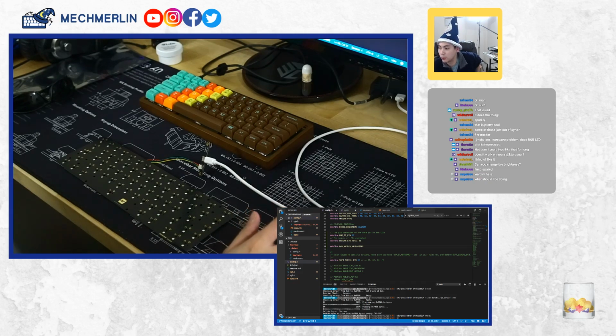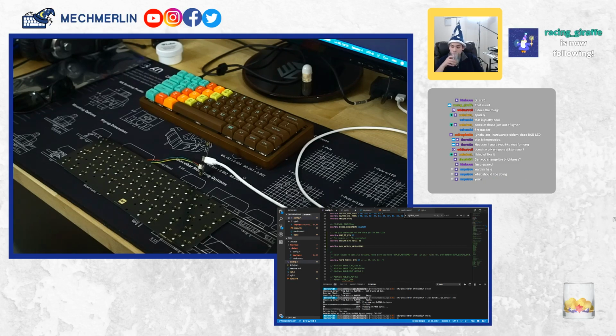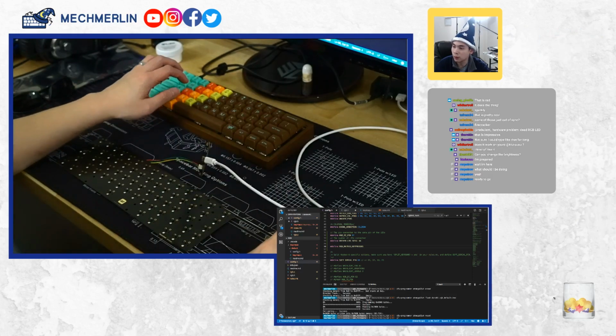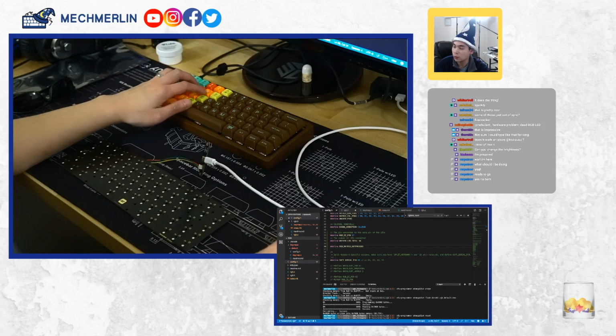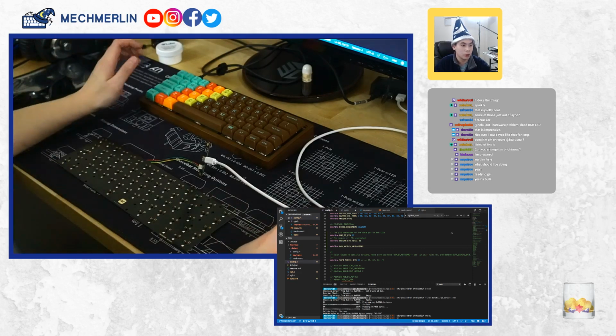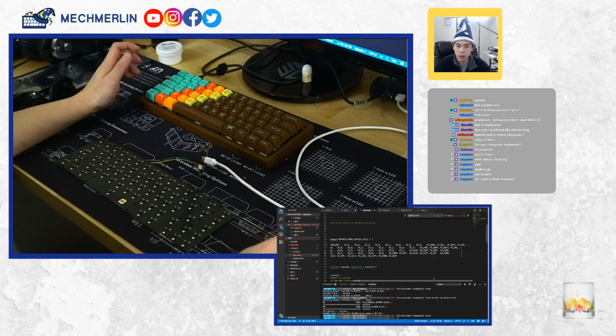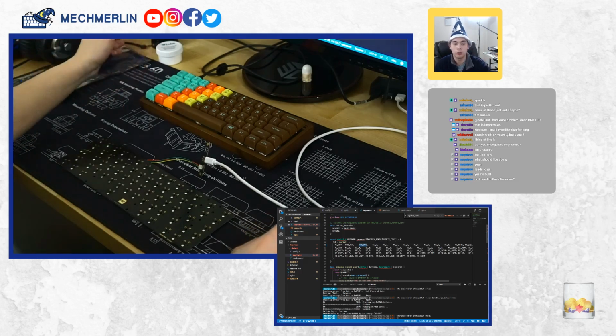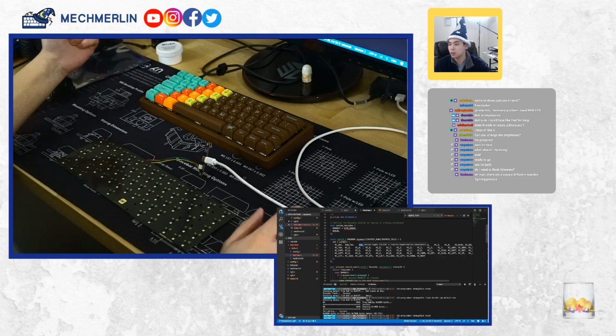Oh, Mr. Petrov, do you have yours built? Wow, you are quick. Did you just get that board? Okay, I'm gonna send you a hex as well. So 3 people have reactive lighting. Here. I just sent you the hex file. Kindly flash it on your keyboard and let me know. The way that I have the key map built is kind of wonky. Your RGB Toggle is where 1 is located, and the RGB Mod, which cycles through all of them, is the number 2 key. So just play around with that.